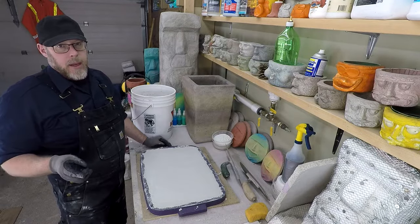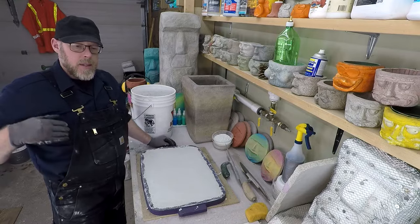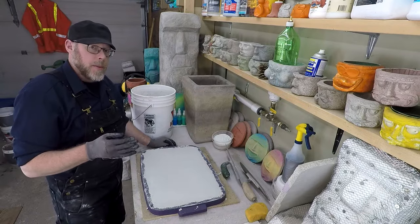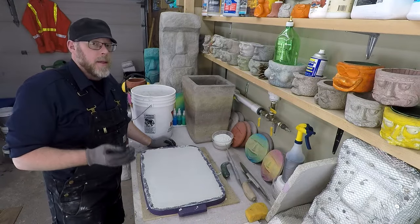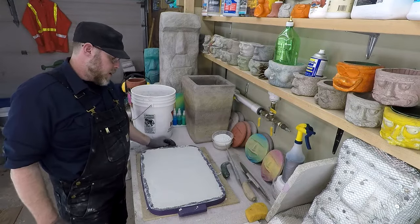That's the process of wet curing in a nutshell. You add water to it such that it's going to retain the water inside it, not letting it dry out completely, and that way you're not exposing it to the forces it will eventually face because of the nature of concrete — it shrinks as it cures.